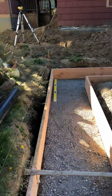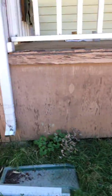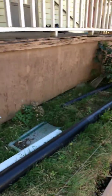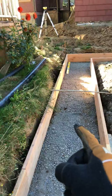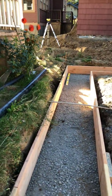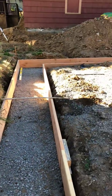We're going to connect the sewer to the municipal sewer supply. I've got a water supply coming from the house, so we're upgrading the meter for the house and running a one-inch water main into this foundation wall. You don't need to worry about the water main now because it's going to come through the basement, which is higher than the ground level, coming through a concrete patio here.